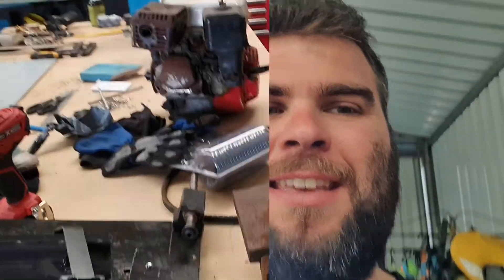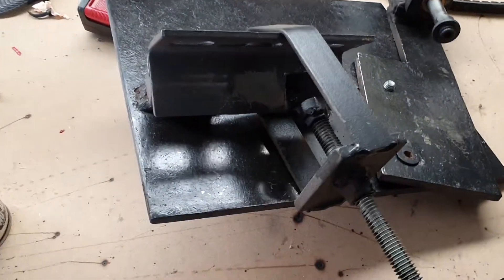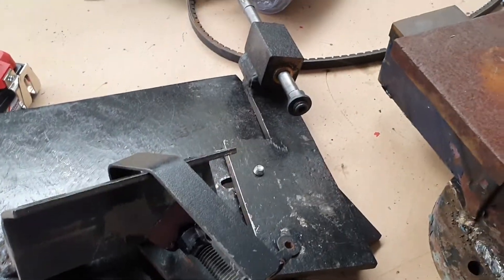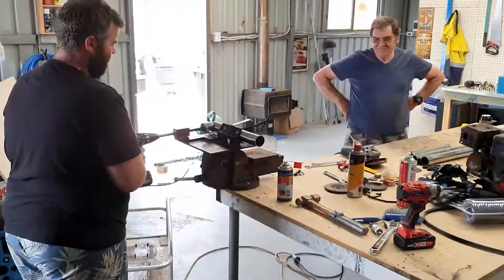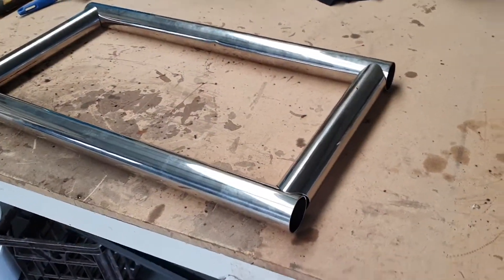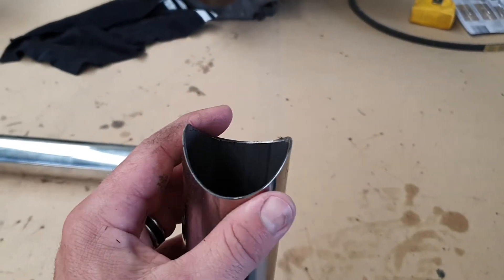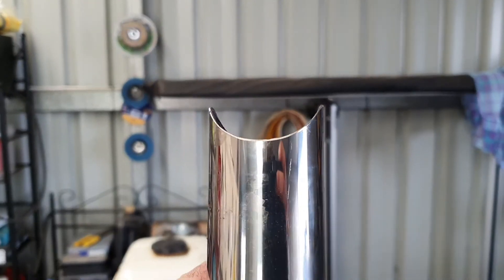What we're going to get into now is making the base frame, which we'll start with our two-inch tube. I've recently got my own place with my own gear so we're still figuring it out, but we'll get there. This is my pipe notcher — it doesn't look special, but it works very effectively. We coped these all in and did a bit of clean-up work just off camera.